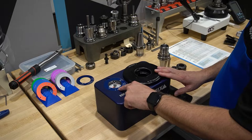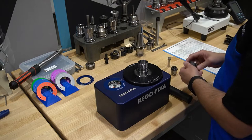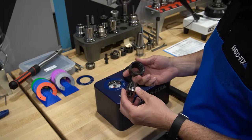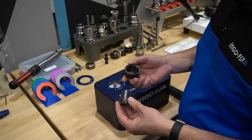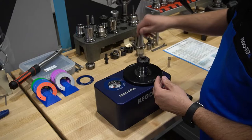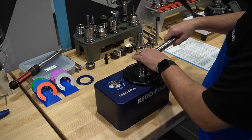We are back over here at our Torco block again and I have our ER32 ring already on the Torco block and I've set my maximum torque at 100 foot-pounds. Let's go ahead and put my tool holder in. Now this is the collet with the dried coolant on it. This is kind of what you're going to have or see when you're in a hurry in a shop and blowing through things relatively quickly. But what effects does that have, if any, on the final product? If I actually rub it, I can feel a little bit — you can see the shininess on my finger. I'm going to go ahead and assemble this, and we will put in one of our half inch torque pins, and let's torque this down to the full 100 foot-pounds.